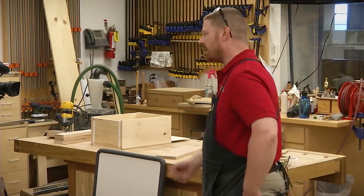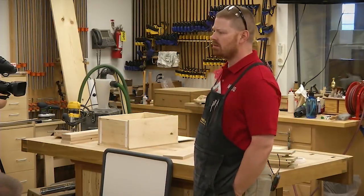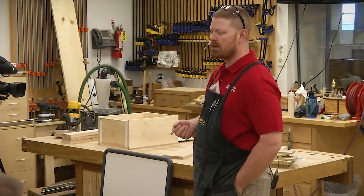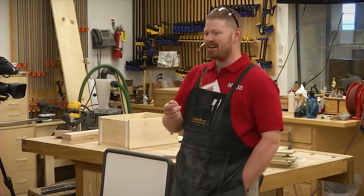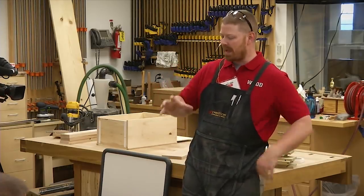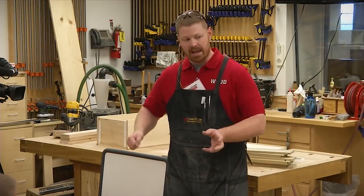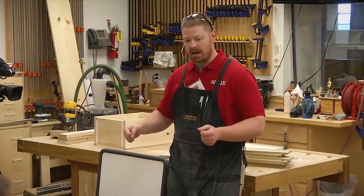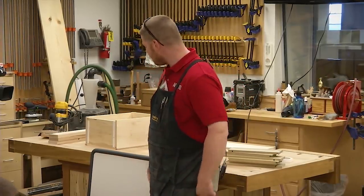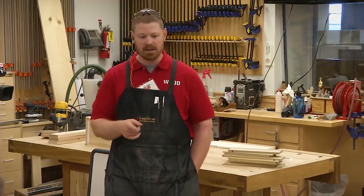Well, that was fun. We found this material at Lee Valley. They sell it in big sheets. And it's an adhesive-backed foam pad, and it really, really works well on push pads. So you can do stupid things and get away with it. You might have noticed when I was cutting the groove, I had my double push pads on there. With something that I wasn't comfortable that the pad is actually going to grip the wood, if I don't have a positive stop behind the board or a hook, I can't be 100% sure that the board's going to go through as I push it. So this allowed me to do that, put pressure down on the board so I get a nice even groove on the side. And part of the reason I wanted to show you that is because the next cut we have to make is kind of stupid, so I warned you going into it.